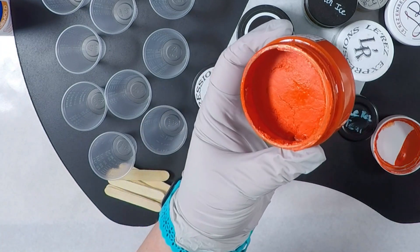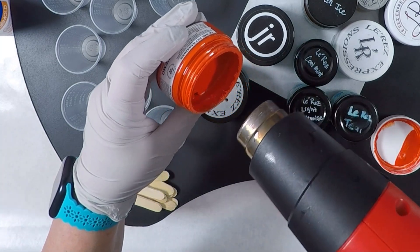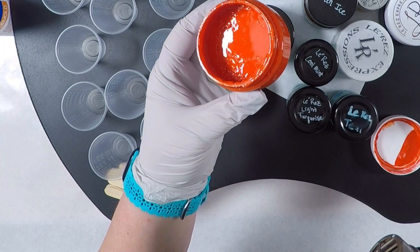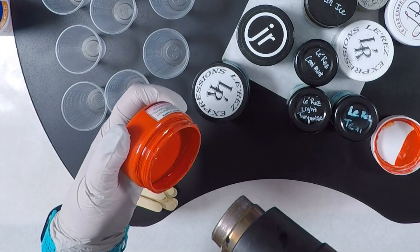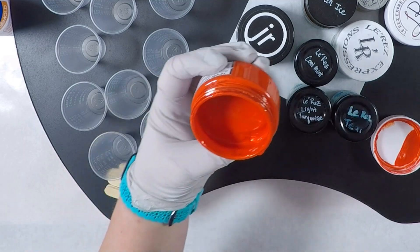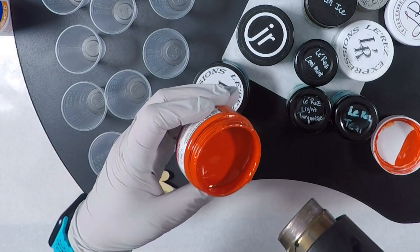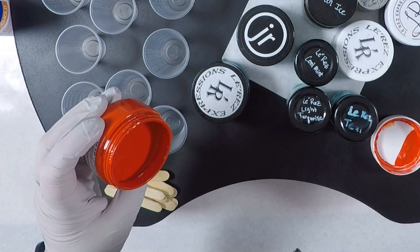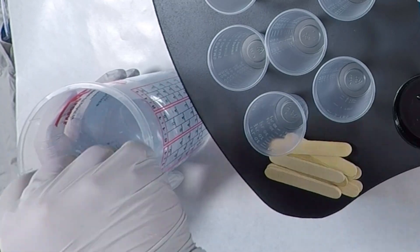I want to mention: if you have paste like this in these type of containers, sometimes they'll harden up. They're still good, so don't worry about that. All you need to do is warm them up. I usually use my heat gun on low heat, but you can also use a hair dryer or put them in a Ziploc type bag and stick it in a hot water bath for about 20 to 30 minutes. If it has liquid on top, you'll want to warm up the entire jar — usually I do that with the hot water bath — and then stir it all together. If it's just a solid like this one is, you'll just need to heat up what you need. Keep it moving on low heat so you don't overheat the product or melt the container.